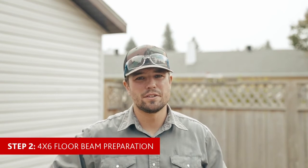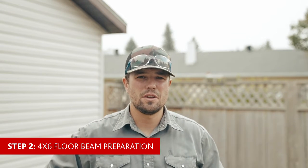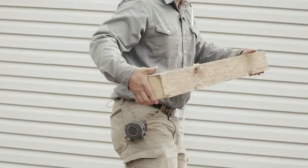Now that we've finished with step one, placing the blocks, we're going to move on to step two, which is the 4x6 beam placement. Now, just make sure that you revert back to the assembly instructions and check the orientation of the brackets so that you know which brackets are going to be installed flush to the edges of the beams and which brackets are going to be installed to the center of the beams.